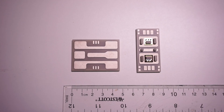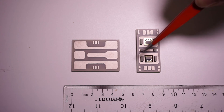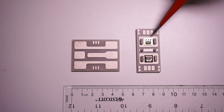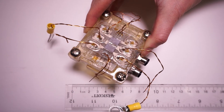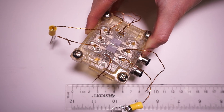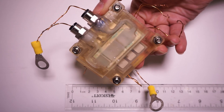Shown here is a prototype of the power module. It includes two 10,000-volt silicon carbide MOSFETs and the molybdenum posts. This is the top DBA substrate that will then do the interconnection between the high side and low side switch. Shown here is a prototype of the 10,000-volt silicon carbide MOSFET power module with the housing and encapsulation material. Inside the housing is an integrated jet impingement direct substrate cooler that was designed by the University of Nottingham.